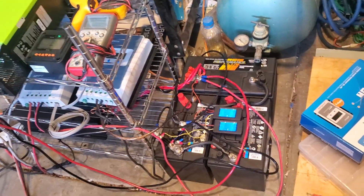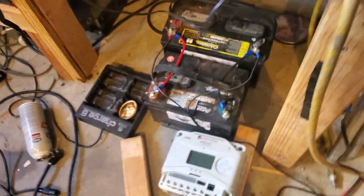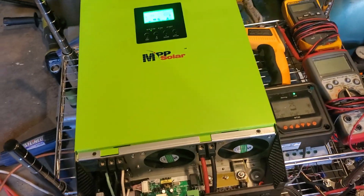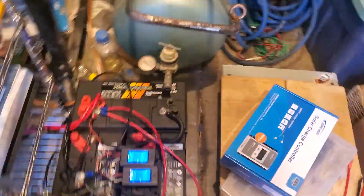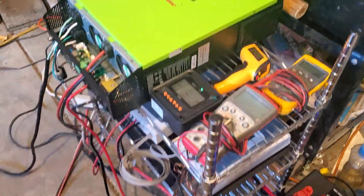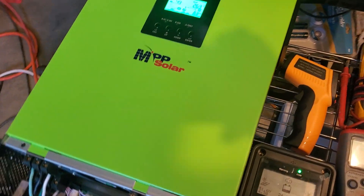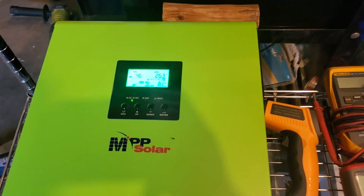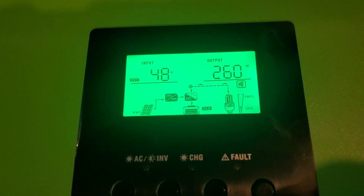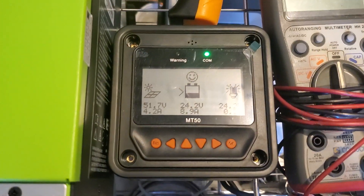That's a quick tour of my solar setup. I do have another setup over here — this is just on some Harbor Freight panels that I really just need to take back. The only reason I've been hanging on to them is they're fairly portable and easy to move compared to a used residential panel, but they're not realistic as far as efficiency goes — $100 plus for 100 watts that you're not even going to get 100 watts out of. So anyway, we're dwindling over here. So much for running the air conditioner today.